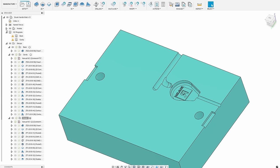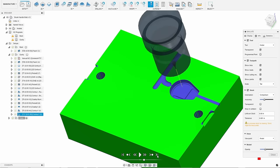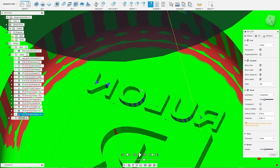We're looking at the cavity — I'll right-click and simulate. Once the calculation finishes, I'll zoom in. You can see what I was referring to with having to use small end mills and the difference between 3D printed molds and CNC machining. The blue areas here are areas that cannot be machined with the end mill I'm using — in this case a 0.015-inch (15 thousandths) diameter end mill. I could do a little better going down to 10 thousandths or smaller, but we decided to try 15 thousandths and see how that worked.